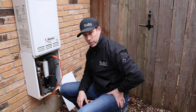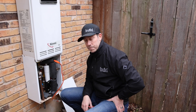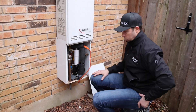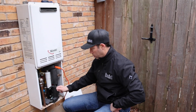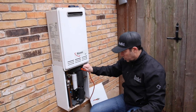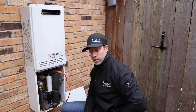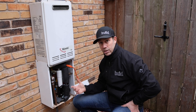If temperatures drop below 10 degrees for multiple days, we could still have a problem. So how would you recover the next day if you didn't do this? Here's what you need to do: take this cover off. Let's say you wake up in the morning, turn your hot on, and nothing happens — take this cover off and get the pipes as exposed as possible. With a hairdryer — not a heat gun, but a hairdryer — slowly move it over all these pipes. Leave your hot on in one faucet, and as you slowly apply the hairdryer, the water is going to start flowing again. You'll hear the unit kick on and it'll start making hot water. The other thing to consider: if you've got extreme cold happening, put a little stream — a heavy drip — on the hot side to keep that water moving through there.